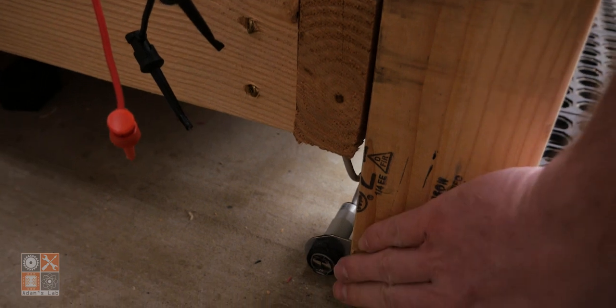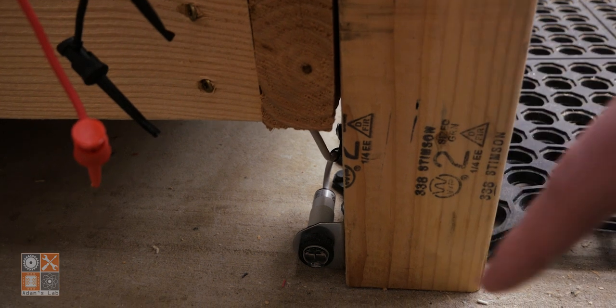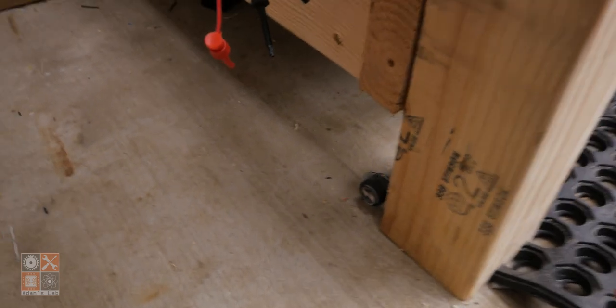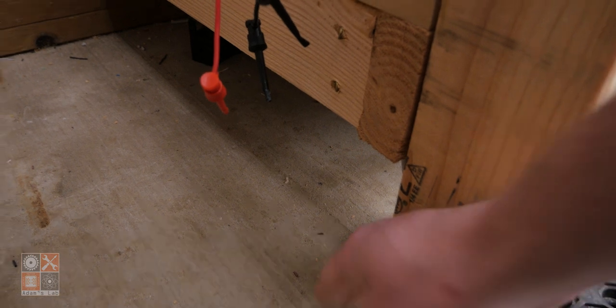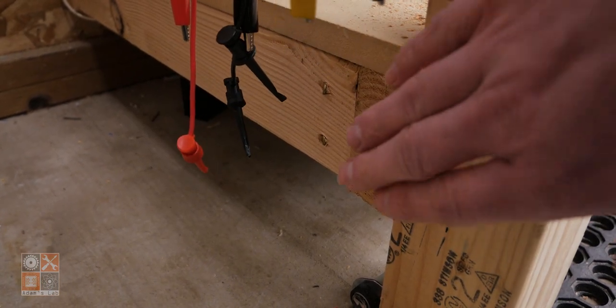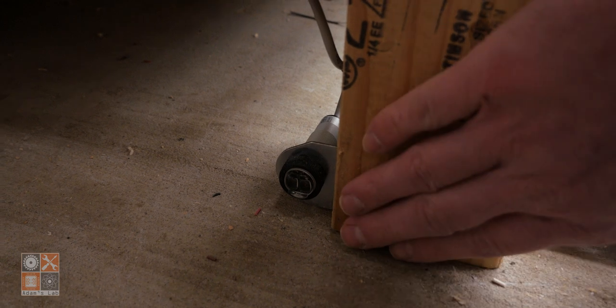So these are the same sorts of things that, if you've ever been in a convenience store or 7-Eleven or whatever, and you got that ding ding as you walked by the door, that's basically what's being used. It's shooting a beam of light across, hitting that reflector, and then being reflected back to it. In this case, the way I have this one configured, if the beam is broken, it turns on a relay that's mounted in a case up underneath the bench here. That relay is then used to set the pin high or low, depending on if the beam is broken or not. So these break beam sensors are a 9, I believe, to 30 volt device.